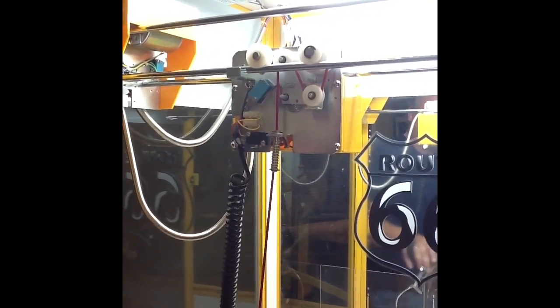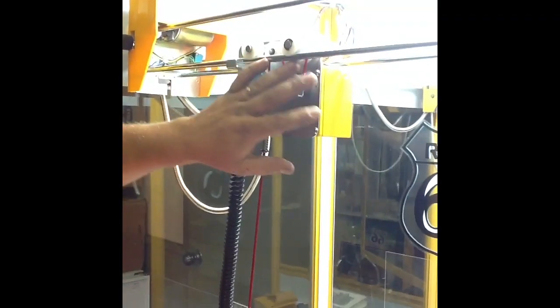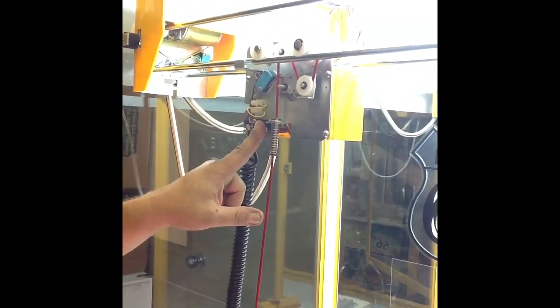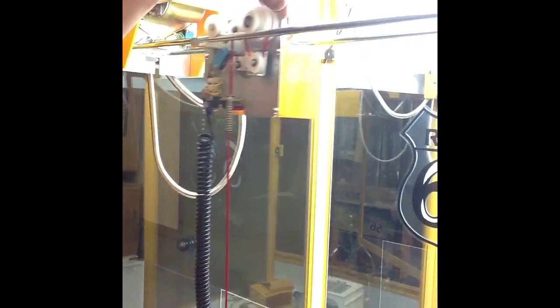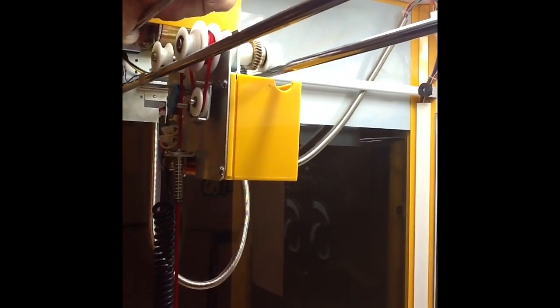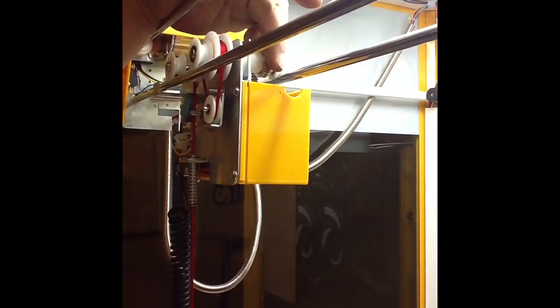On the second half of O1: once we get an O1 error code, if it's none of those problems, then you either have a bad switch, broken wires, or a bad motor. You could also have a bad gantry gear — up top here is your gantry gear. You got that gear right there, it meshes up against the motor shaft. You have to make sure that gear is not stripped. If the gear is stripped, it could be sitting there spinning, but you would hear that.